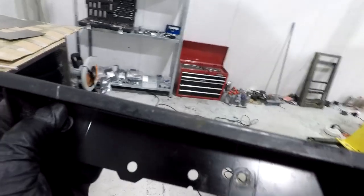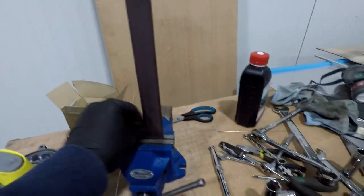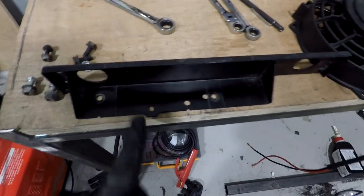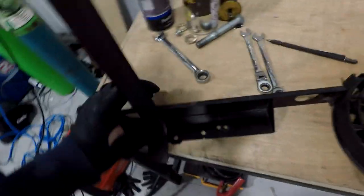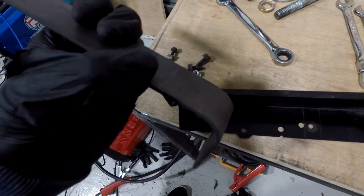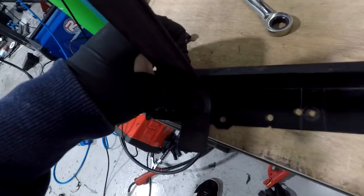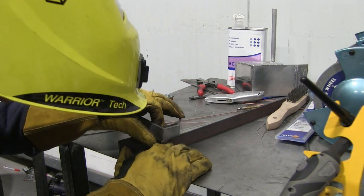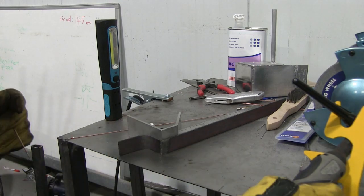I've taken the bracket off and the oil cooler, and this is what we've got to work with - I've drawn a few lines on it to give a rough guide of where it's safe to put stuff. We've got this bit of metal which we're going to bend - 3mm thick steel, maybe a little bit of overkill but no harm. It's going to be flat against there, then come 90 degrees up, then 90 degrees again - that's what's going to hold the fan in place. We could either use some scrap 2mm stuff that's easier to bend, or just cut this here and weld the vertical bit to it - I think that's probably the easier option. I'm pretty new to TIG welding so you'll have to forgive me if this turns out pretty shit.